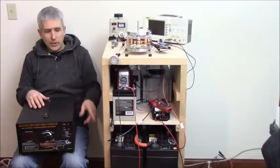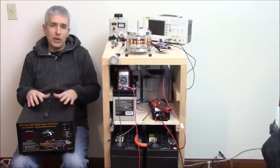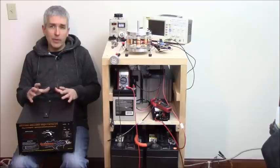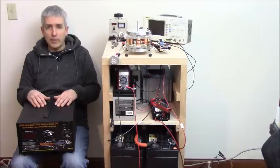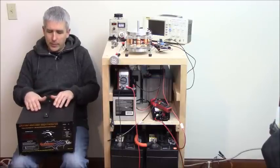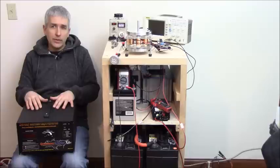In fact, right now I'm discharging the batteries here down to 0 volts, and I'm doing that for 2 reasons. One, I'm removing all the positive energy out of the battery, or I try to do that each cycle until I can remove it. The other reason is I'm just deeply discharging it, so when I charge it back up, I'm going to really get to the full spectrum of the plates and fully condition them. So we do a conditioning process also with this, but it's more of an increase of capacity conditioning. So we cycle the batteries several times, 3 to 5 times, and on an old 3 to 7 year old battery or older it may take a few more cycles.